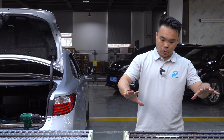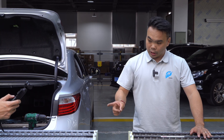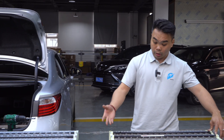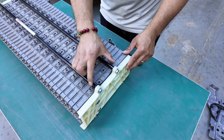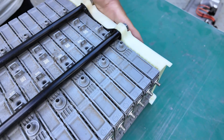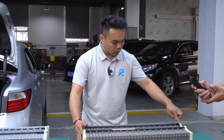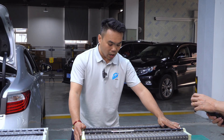I'm going to show you how to remove the old battery and install the new singular ones, but there are some main points to cover. When you see the old battery or the brackets, some of the battery bars are connected. When you are trying to remove it, do not remove your battery cells on this side — disconnect it on the opposite side of this bar, because you cannot install the battery pack this way; it's being blocked.